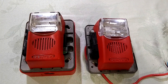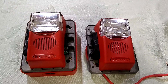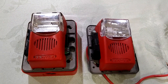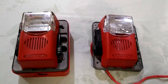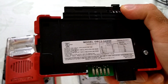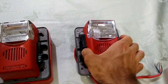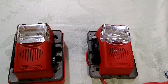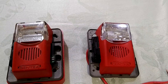Like the Wheelock MT, the Gentex Commander series is multi-tone, but it has only 7 tones rather than 8. There are actually two dip switch combinations that both produce the slow whoop tone. Before we go ahead and sound them off, I just wanted to point out one little interesting thing. The tag on this actually says GEC324WW, indicating this unit was supposed to be white. So was it mislabeled as a WR, or is it actually a WW with the wrong color? Leave a comment with your opinion.